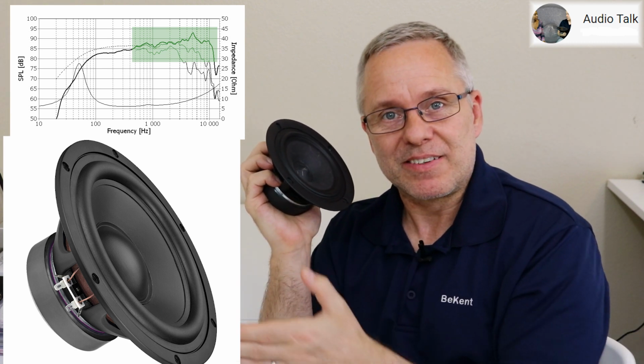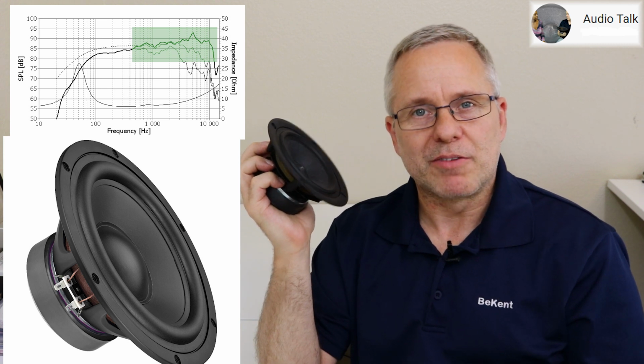Yes. So polypropylene, there's a lot of variation to polypropylene. It's a plastic material, so it can be very warm to listen to, and it can be sterile to listen to. It can be both. One mixture of polypropylene can be one thing, and another one can be another. So there, you need some experience listening to the different types of woofers. Price would typically be a fairly good indicator of whether it's good or not. And then you can look at the frequency response, and if there are a lot of irregularities, then it's probably fairly cheap sounding.